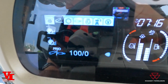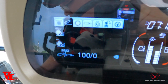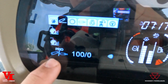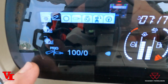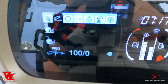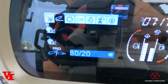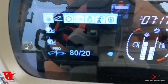The next screen is about our hydraulics — this is our rear power lift setting. We've got wheel slip control: you can set your maximum permissible wheel slip and prioritize the hydraulic flow. This has an open center or closed center pressure flow compensated hydraulic system in this version. The priority — and this is one thing — when you hit the three-point hitch, what has priority: three-point or remote valves? I like to change this and give it at least an 80-20, because if you're going to do a three-point you want it to do that first, then go back to hydraulics. So we're going to hit OK and that is saved.